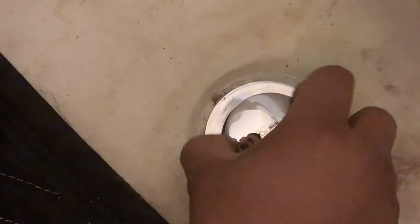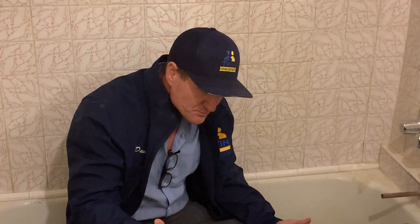There is a complete drain. Now we're going to install the toe kick — that's simply the threads and the washer. Just screw it down; this doesn't have to be super tight, just hand tight. There it is — it's called the toe kick. Well folks, there you have it — how to install a tub drain. You're probably wondering what a tub drain installation costs. Depending on your plumber, whether you're using a handyman or a licensed plumber, I've seen it range anywhere from about $250 all the way to $1,200. It depends on accessibility, how much pipe you have to cut out, and what type of drain system you want. Hopefully this helped — thanks for watching, and if you like it, give us a thumbs up and make sure you hit that subscribe button.